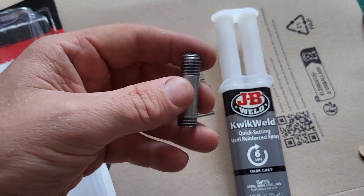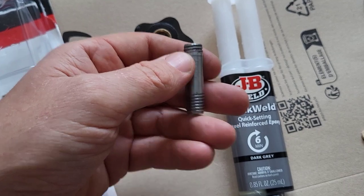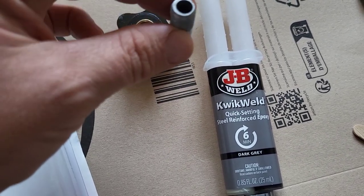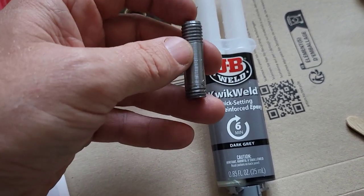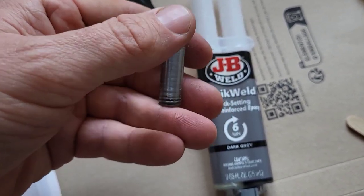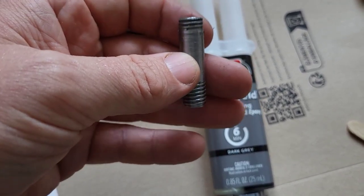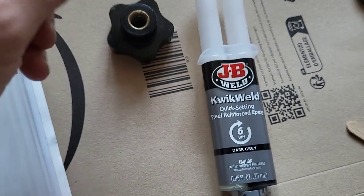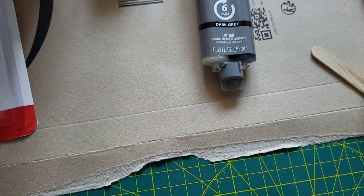So I've re-threaded this little gubbins, which I'd actually done the wrong side of before. It's very, very hard to get the tap and die completely straight — when it went in, it went in at a bit of an angle. I had a little look on YouTube and there is a technique: if you put it in a pillar drill, you hold this in the pillar drill and then push down, and just with your hands turn it to get that initial bite. As you can imagine, it's a complete 90-degree angle. As soon as you get that bite, you then take it off, put it in a vice, and do it by hand. And it's worked perfectly — I managed to get a completely straight thread. It's just about getting that initial bite and then the tap and die will take you down straight.